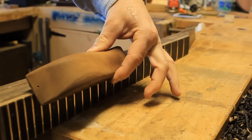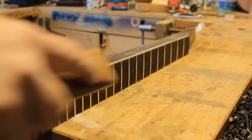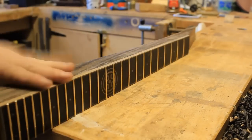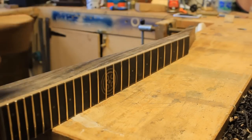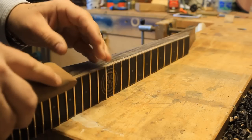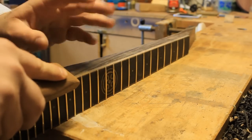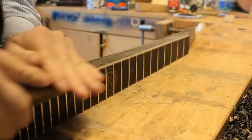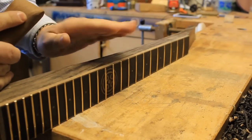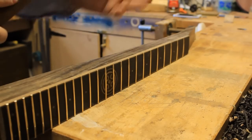I'm angling the tool roughly at a 45-degree angle to the side of the neck. These frets are the hypoallergenic alloy and they are harder — they're not very kind on my tools. However, you can hear when I'm touching the metal. Now listen for the change in sound. Suddenly I'm not touching metal anymore, or not predominantly touching metal.